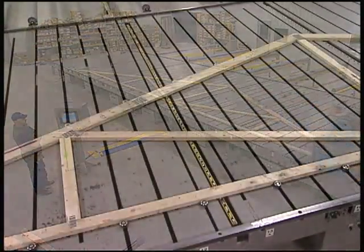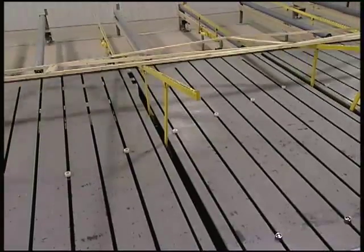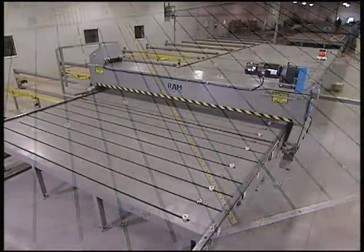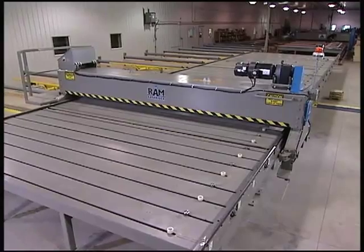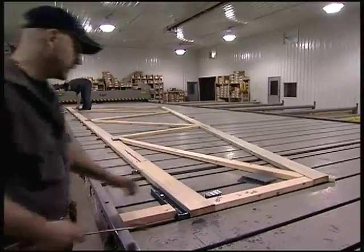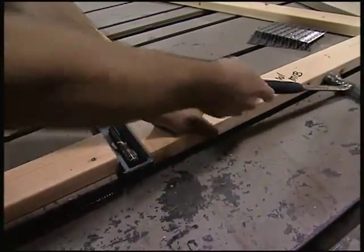Powered stops are positioned 22 inches apart. The operator can quickly decide to use them all on the top cord or alternate between the top and bottom cords. This provides a sufficient number of jig stops to lay out any truss without unduly increasing the complexity and maintenance requirements of the system. With the C4 jigging system, all trusses are built with a single heel stop. No additional jigging is necessary.